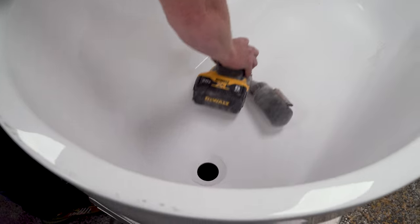A lot of times I'll wash it down with alcohol in between sanding passes because it really helps get any hidden pieces of silicone or debris that would create fish eyes in your main coat. So either way, sanding is still doing something even if you're not sanding into the metal per se — you're still really cleaning the tub. Make sure it's clean with no contamination, and then we're ready for the main coat.